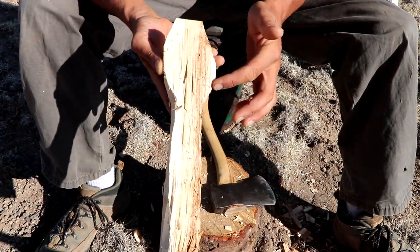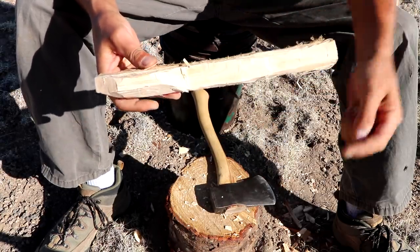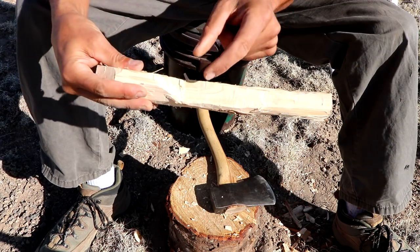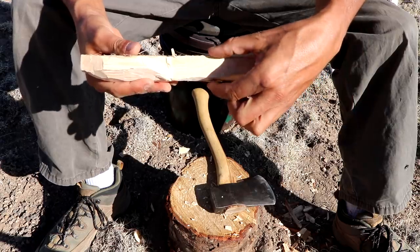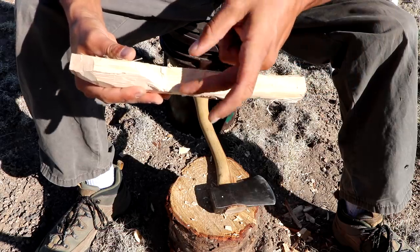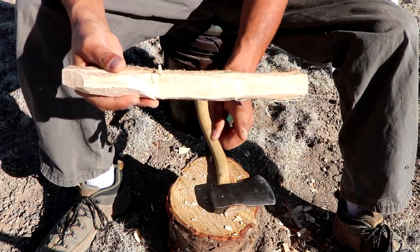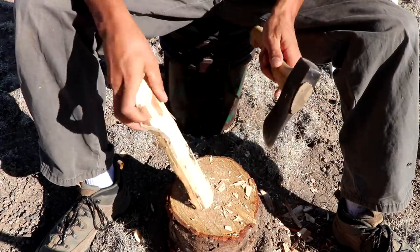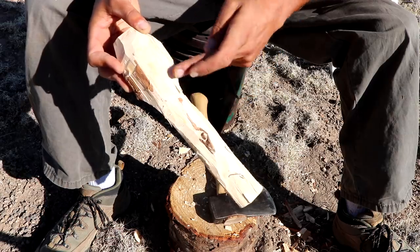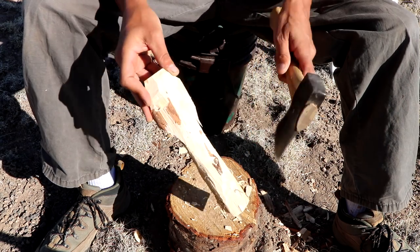I've started to develop a little bit of the shape of the spoon, but now it's time to think about the profile as well. I want the bowl of the spoon to curve up a little bit, and a little bit of curve in the handle too. The thickness I have will allow me to achieve that curve — I'll remove wood from the bottom to bring the bowl curve up, and remove wood from the top at the end to bring the handle curve down. To do that I start chipping away behind the bowl. I'm visualizing the bowl ending about here — I don't want to go too far in because that would leave the handle too thin and it could break.